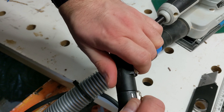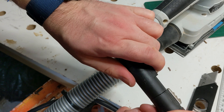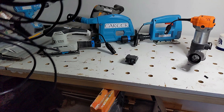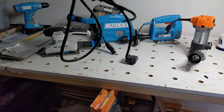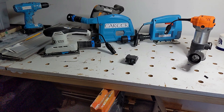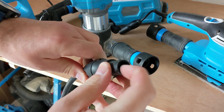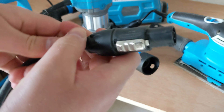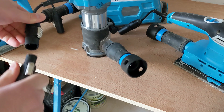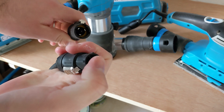So why have I fitted these connectors? Well, the first reason is that it makes storing my corded power tools a lot easier — I don't have to wrap or unwrap the cord when I go to use the tool or put it away. Number two: by having the power and dust collection attached together, I'm going to be less likely to forget or be too lazy to turn the dust collector on — so that's a win for my lungs. Reason three: if I have got a few corded tools at once, I don't have a bunch of cables causing a tripping hazard on the floor. Here you can see the cable that would be live supplying the power tools, and there's no way of putting your finger down into that connector. And here you can see the connectors fitted to the tools and those exposed pins — that's why you'd never want those connectors to be live when you can have it split like that.